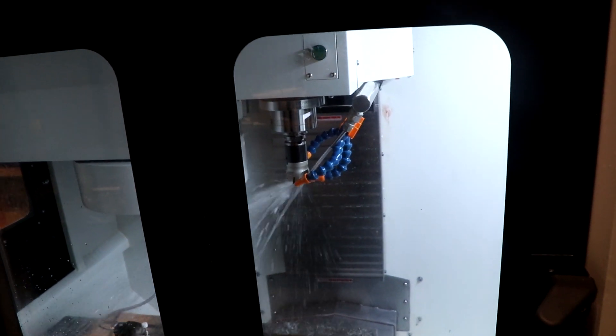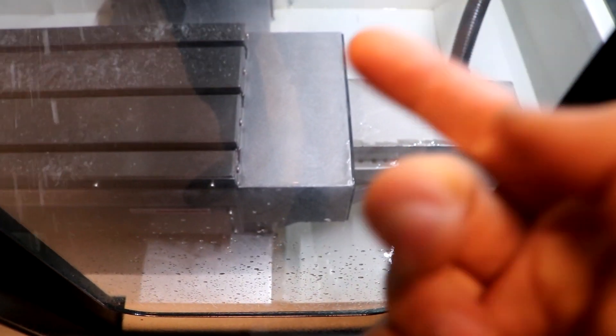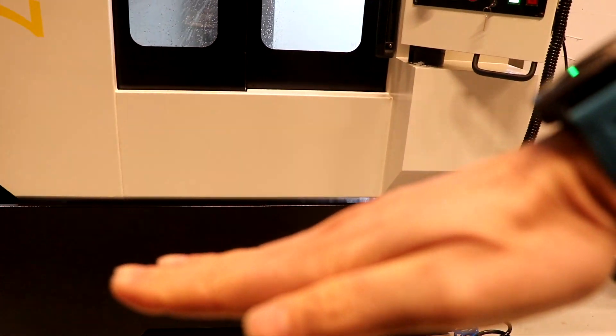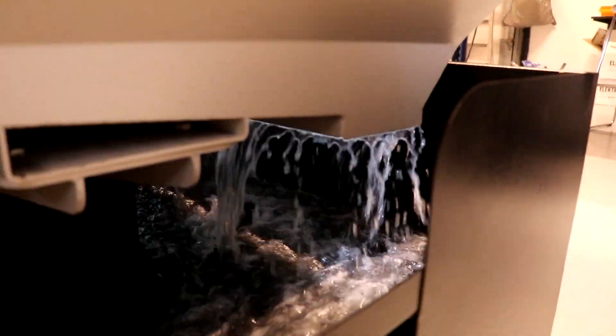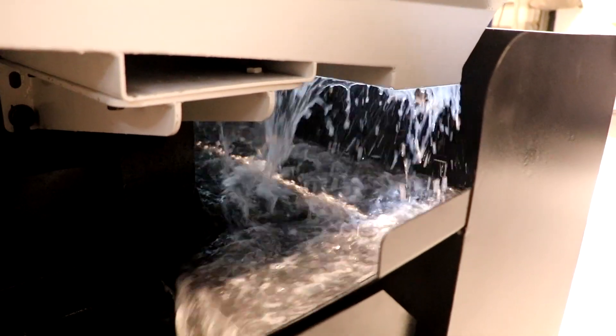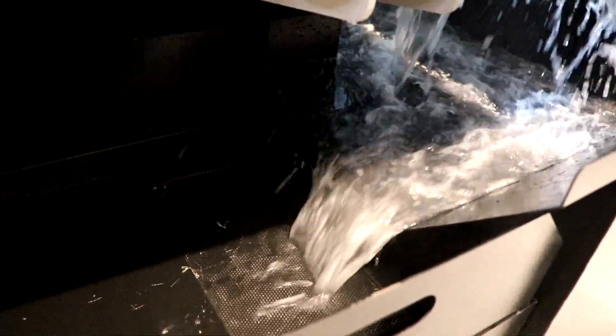So here's a quick overview of the coolant system. There we have the nozzles, and all the coolant that's spraying runs in on that side, and then it goes into this big black pocket which is kind of a ramp. So everything goes like that. Especially here on the side you can see all the cooling coming out — it's quite a nice volume. Everything comes out, goes around the bend, and then drops here on the chip tray. So this is the first four filters, and I think it's a really elegant system, especially now that it's waterproof.